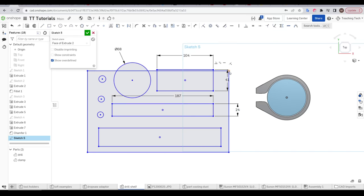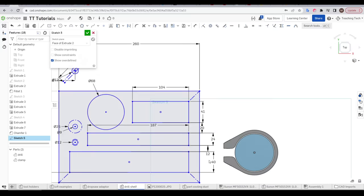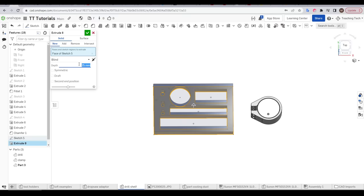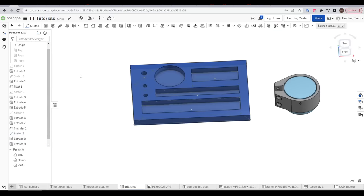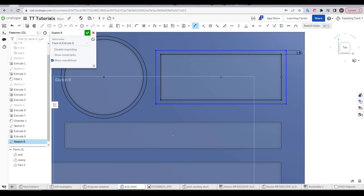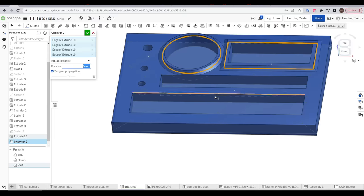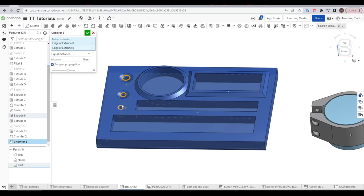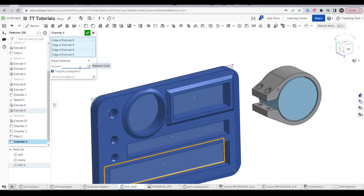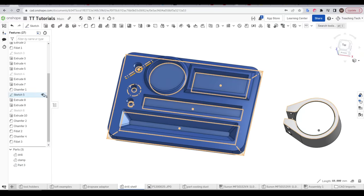After this I could draw an exterior bounding box. After a lot of experimentation I got the packaging a little neater and started to work on the position of the entire tray relative to the clamp. We make this into a solid object with two simple extrusions — one upwards to grab the bottom of the parts, and a second extrusion down to give us a floor. I was worried about the can and the back drill bits being too wobbly, so I created a sketch with an extra border and extruded these upwards to add some extra material. I add some chamfers and fillets to let the design flow better, chamfers on the inner edges to help the parts slide in, and big chamfers on the inside of the miscellaneous parts tray so objects roll towards the center and are easier to pick up. A few fillets to finish and our base design is complete.